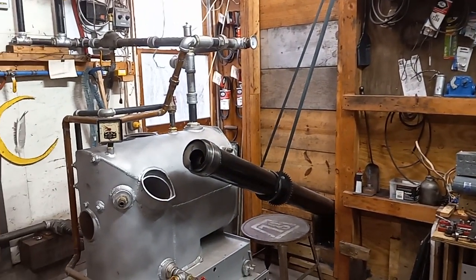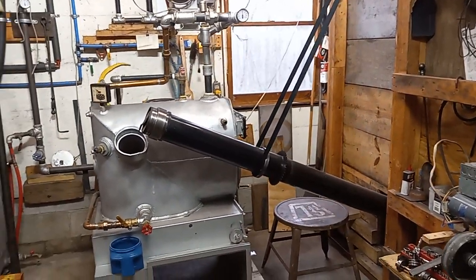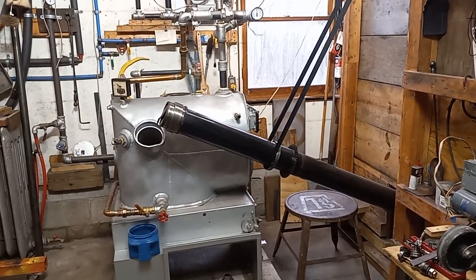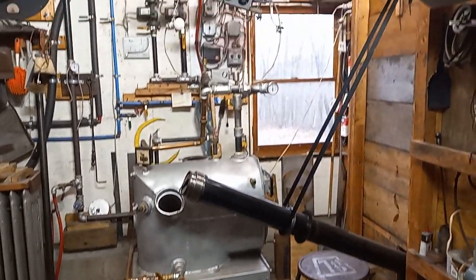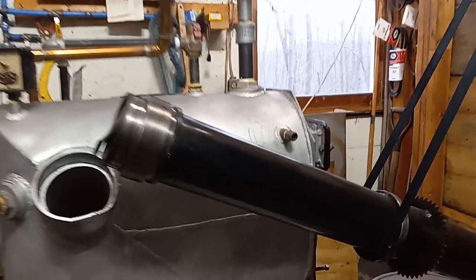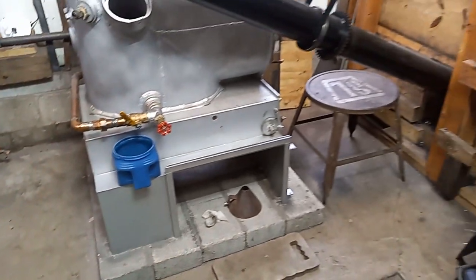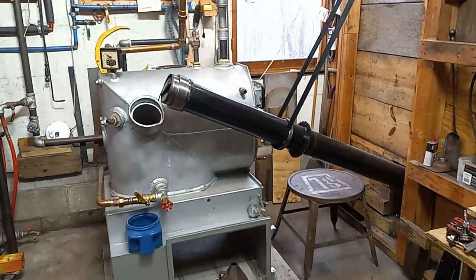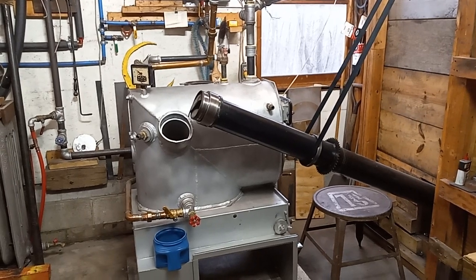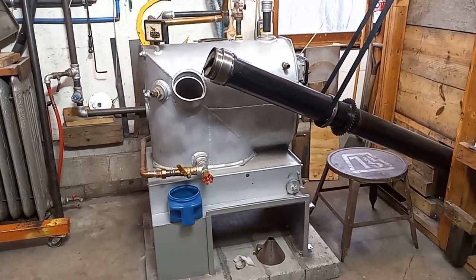We've got some assembly work to do. To run our AHS fan setup, we've got to make sure those studs on the front get all in there and lined up right. And to run the PID ashing controller, we have to drill this out and tap it for a half-inch pipe, and make a copper tube that goes in there so we can put the temperature sensor in it. We'll put the AHS ashing system back on it too, since that seems to work really well.